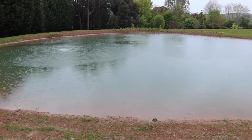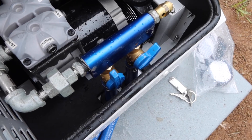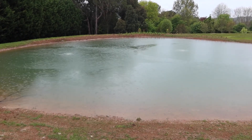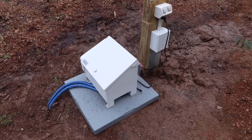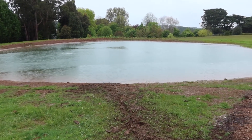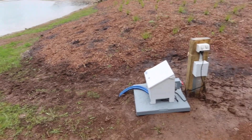Now you can see in the dam what I was talking about — the one on my left is cranking compared to the other, so we'll turn one down and get them rebalanced. That's more of an even spread now. And here we have the finished project — compressor humming away, hose dug into a shallow trench, and a couple of bubblers bubbling away. Tough to see in the rain, getting bloody wet right now! And that's how you install a Vertex aeration system — easy peasy.